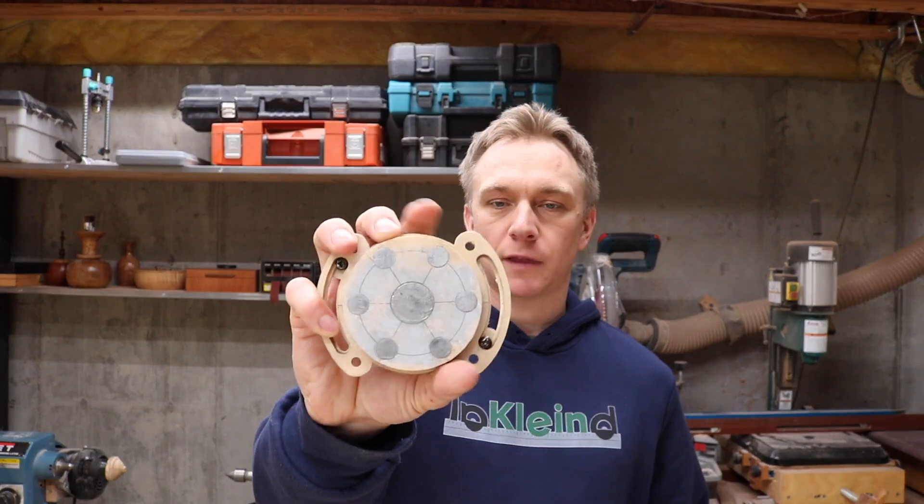Just to touch on a couple of things I glossed over: cutting all the metal plugs to go into the body of the magnet takes a lot of time. If you don't have a metal-cutting bandsaw, hacksawing all of these by hand will drive you crazy. You'd have to make some kind of jig. I don't want to oversell this - you really need a saw for that part. But it did get me thinking about a solution you might hear more about in the future.